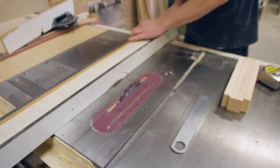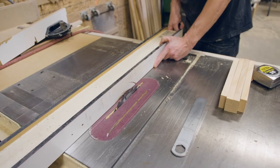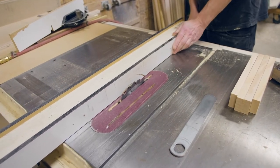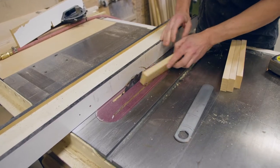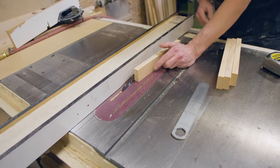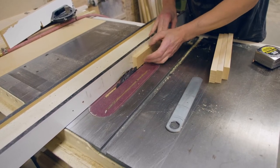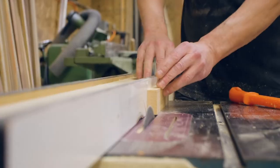Okay, I'm setting this to just a little bit over 1/2 inch thick. Really, I'm cutting about 9/16. I am only going to cut halfway through on either side. It's a little safer with a small piece like this, a little less strain, and when I go through there, my hand's not really exposed to the blade as much, and that's an important consideration.